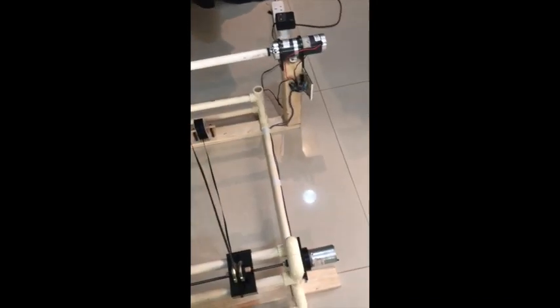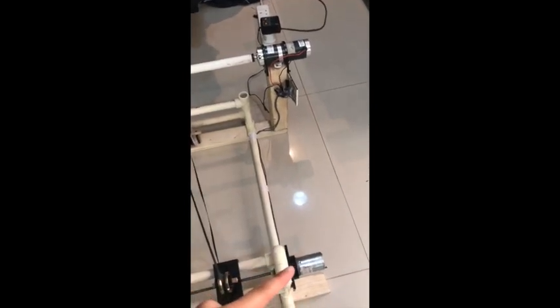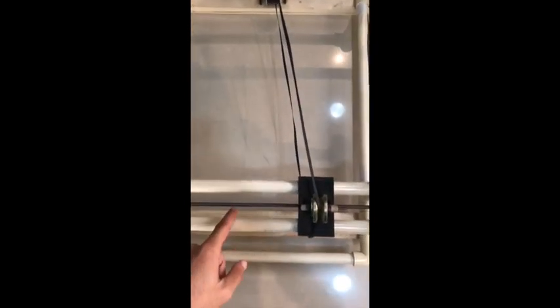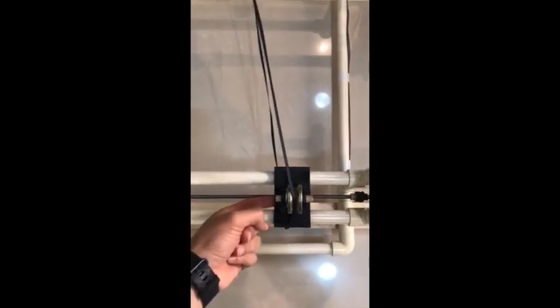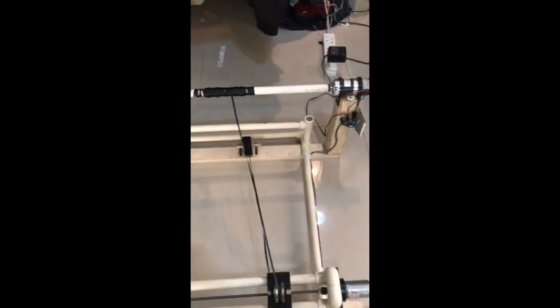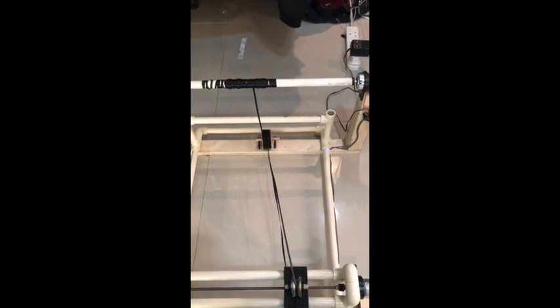How did we do that? By applying a motor here and here. The first motor will create a rotational movement, but due to the mandrel connected to the motor and a nut placed underneath the resin pool, it will move to the left and to the right. The second motor will only create a rotational movement, allowing the thread to wind up the pipe.